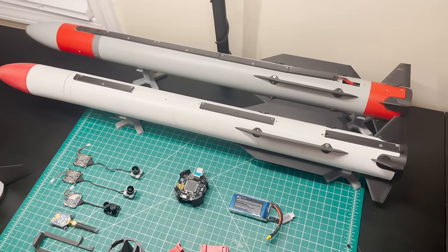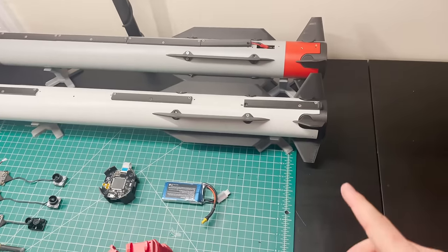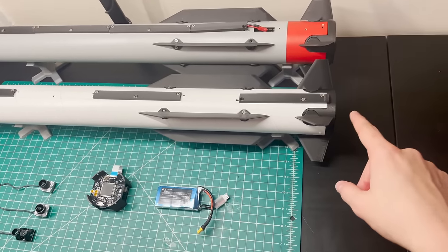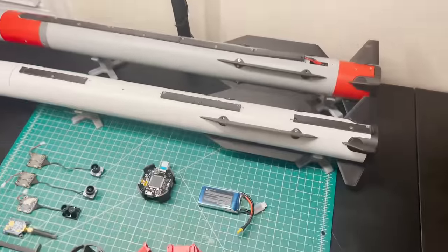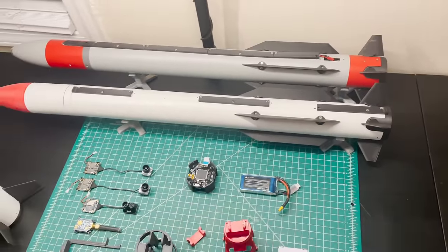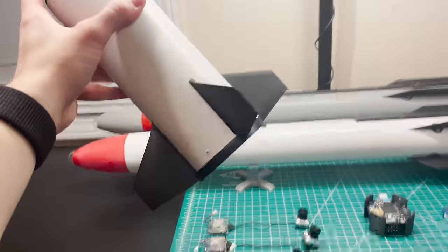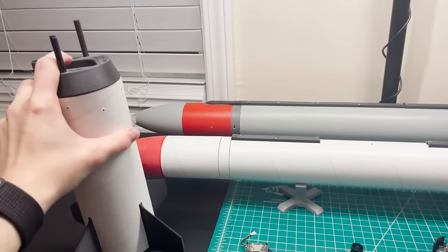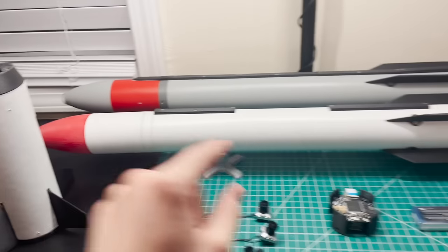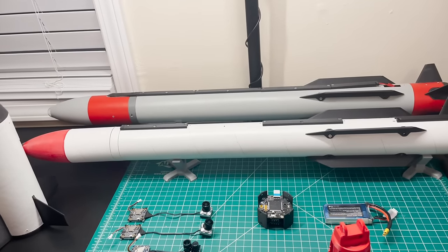We need lines to connect to the booster, other random IO to the booster. We're gonna need pyro channels to separate the booster off explosively and then to fire the main rocket motor. And then we're gonna need even more servo data lines. This is one of the first booster prototypes here. It has a single fixed 38 millimeter motor here. The idea is to fly with a high thrust motor to get this thing off the rail, and then a slow burning sustainer motor to let us practice control for longer periods of time.